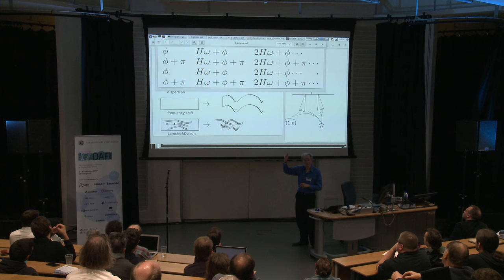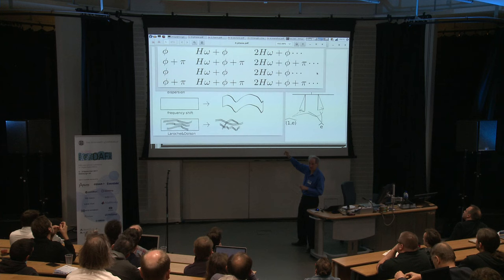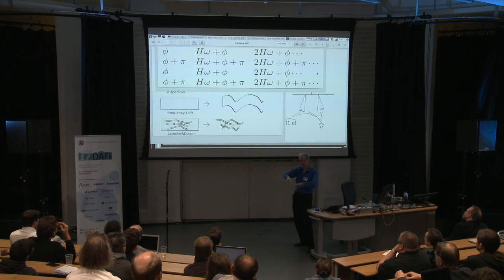And then, hopefully, if it's a well-behaved sinusoid, what happens is at each moment in time when you apply the window, you see the characteristic phase relationship, which is half a cycle every time you look at an adjacent bin of the Fourier transform, which is arranged vertically in this picture, even though it was horizontal in the time versus frequency pictures. Right? Okay, I'm showing you this because